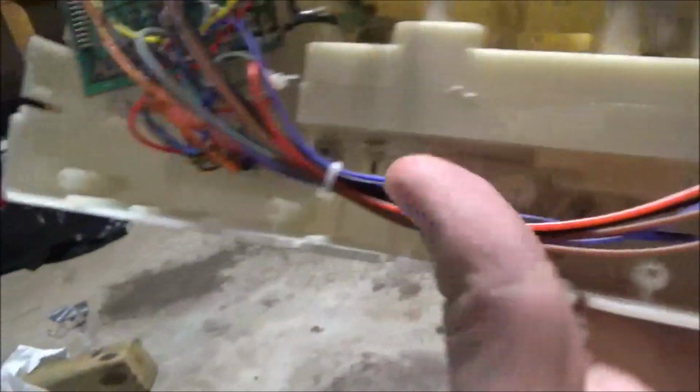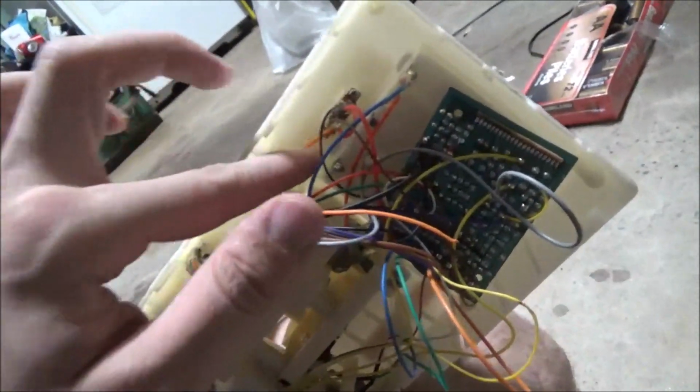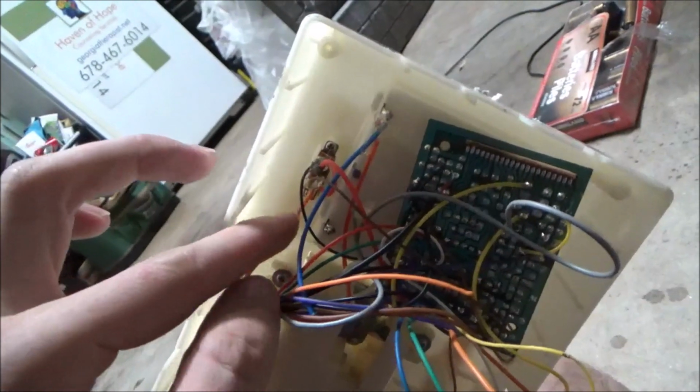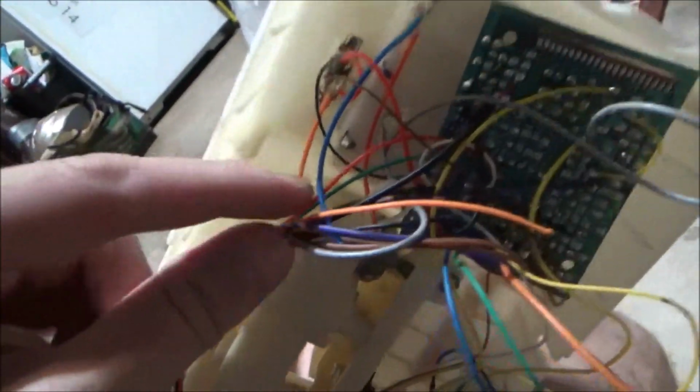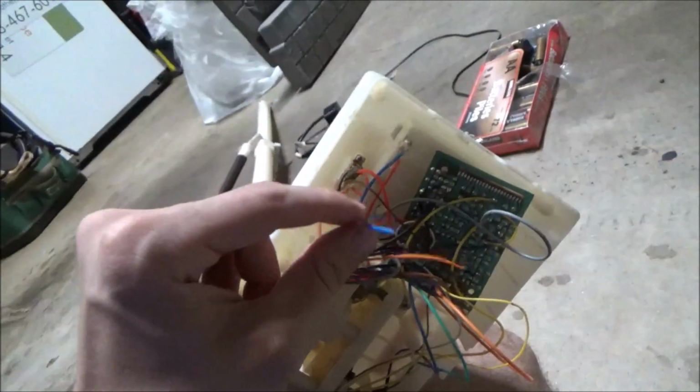Oh my god. Okay, so yesterday Donovan put batteries in it, and it didn't work with batteries. Well, there are 2 wires or 3 wires off the battery compartment. Look, okay. There is an orange wire here that's off from the switch, which probably is what came off when I put it back together. These wires are terrible. Look at that, that's even going to come off. Look at how bad that is. That's not even hanging on there. Like, the wire is terrible. Tekky Toys used the worst wires and the worst board.